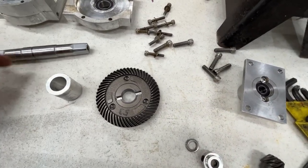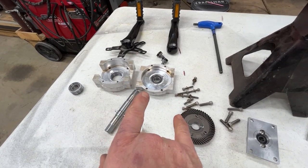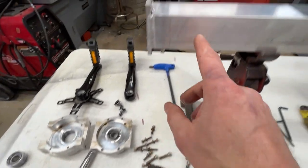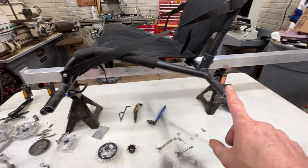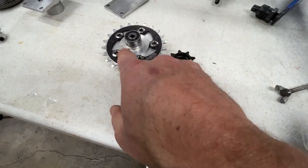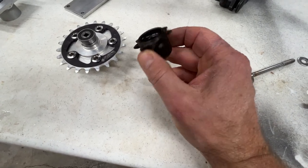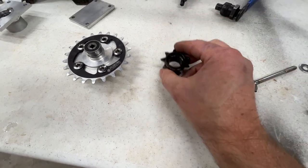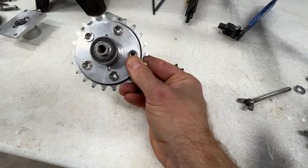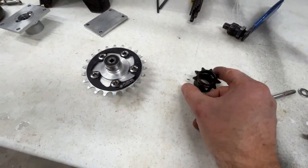I'm proud of this part. The pin goes in there and then that goes in there. So this being the front crank primary reduction, the output is going to be this drive shaft, which will go through the frame. On the back it's going to go to this gear right here — these two together are the same ratio as the big chain ring on my first setup, a two-to-one. This is a nine-tooth BMX sprocket that I found, and this will be underwater on the drive shaft with the prop on it — underwater with a big chain coming up here. I did make this carrier for it with two bearings. I do need to make a case for it and something for the prop underwater, but that's in the future.